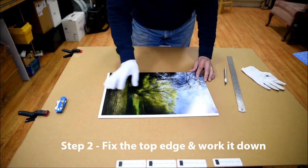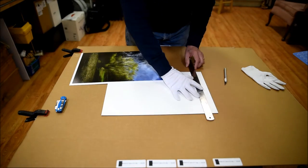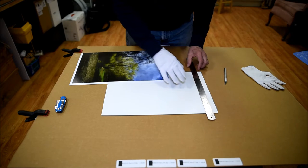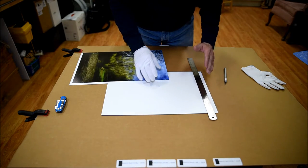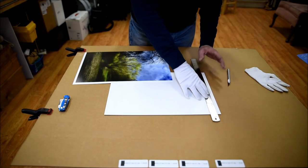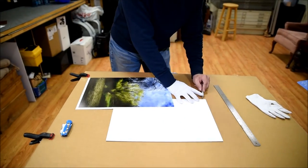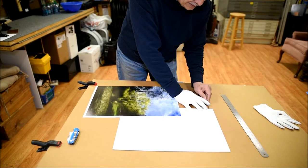Once I've got it lined up, what I need to do is trim a little bit of the edge right here. The amount you trim is not that critical in one sense — if you get everything right and don't make a mistake in laying it down, it's going to be fine. You can cut half an inch or one inch, but if you do make a mistake and this end drops out of alignment, pulling it back up with a thick margin cut is going to be very difficult to correct. So I'm going to trim about one-half inch off, scoring it, and then lift one corner of the short edge and the long edge so I can curl it back and get it out of the way.